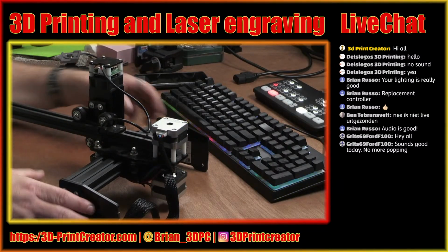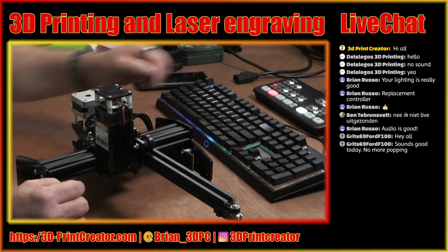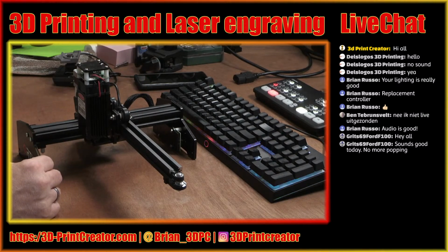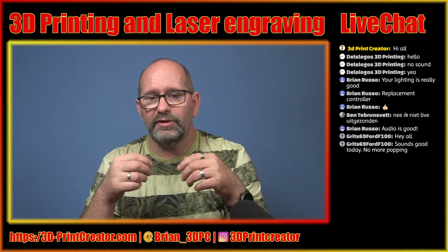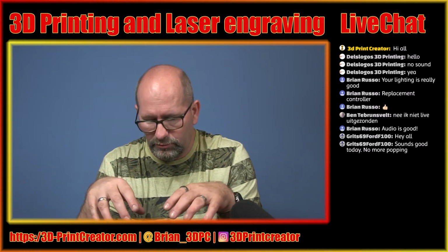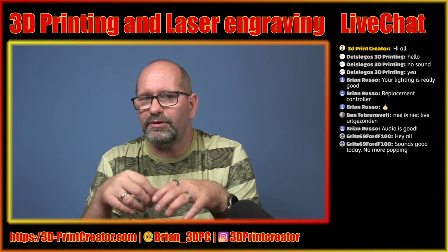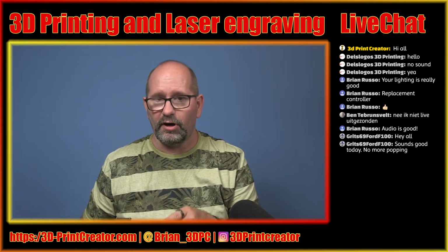Everything had to do with replacing that board that is over here in the machine. When I replaced that, everything was fine again. It turned out that the stepper driver on this board was broken. So I had to replace the whole board because I don't have a reflow station, so I'm not able to change things on the board itself. If I had a reflow oven, then I maybe could have changed the stepper driver itself, but I don't have that kind of thing, and these parts are really small.